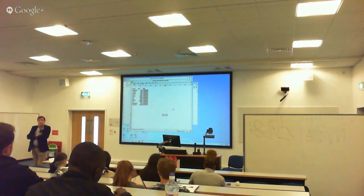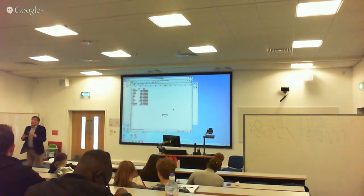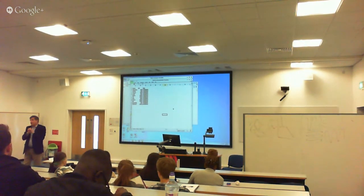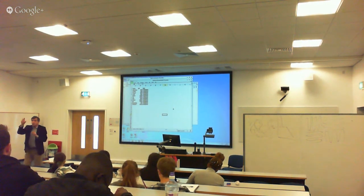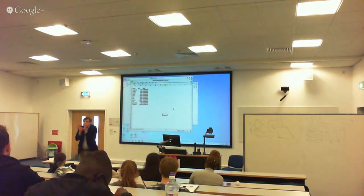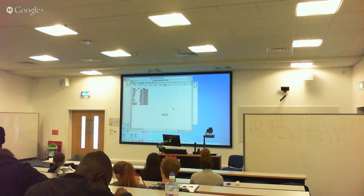Is it forging? Forging, yeah. Extrusion, rolling, these are the main ones. Then there are processes very similar to extrusion, like for example tube drawing. Strictly speaking, it's not called extrusion. The main feature of extrusion is that the metal is forced into a die to take the shape of the die. If the die happens to be tubular, we get tubes. If it's hexagonal, we make hexagonal, okay?